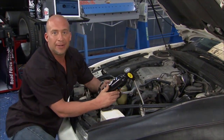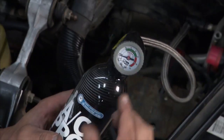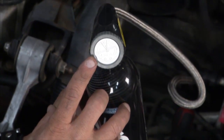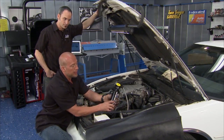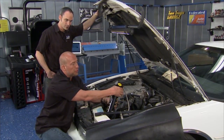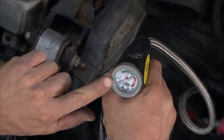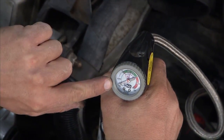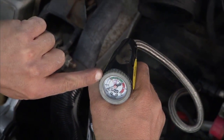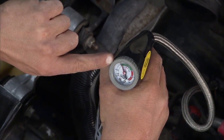We have it connected right there, so that's going to give us a reading in a second. A really cool thing about this is you can set the temperature. Here it's about 72 degrees, so we set it to about 72 degrees. It's basically just a trigger — we have it hooked up to the low port side and you're ready to squeeze. Now when we let go of that, you can see it's filling it up. At 72 degrees, you want to get it in and around the green. When you let go of the trigger, that needle is climbing. We're already in the green, we're getting drier.